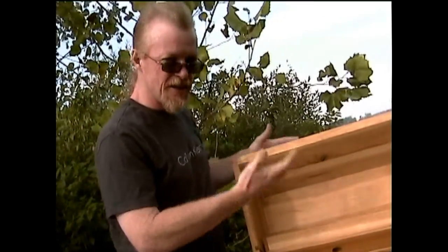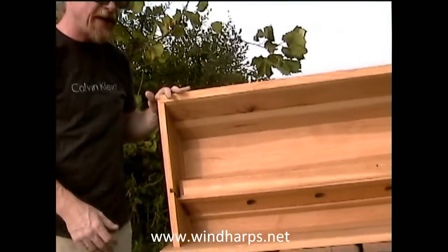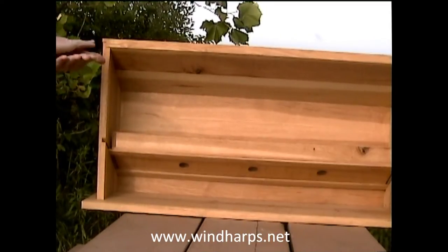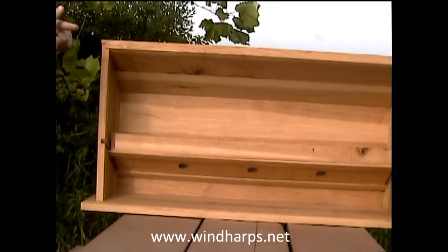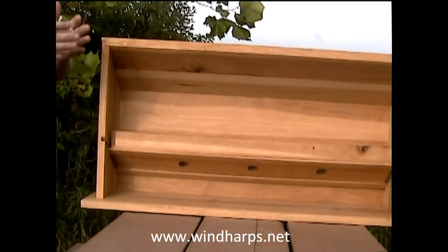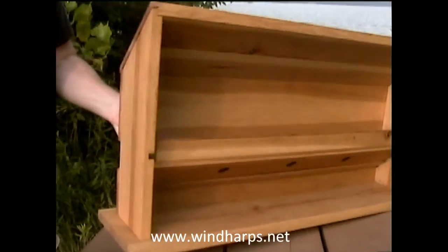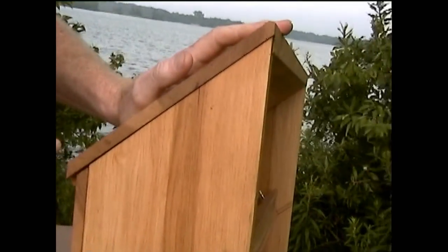This is a historical recreation. It is crafted out of quarter sawn hickory. If you remember from our series last week, I described how the various woods were cut. The flat sawn material, where it's sliced through the log. Then there's the quarter sawn material, where the log is indeed quartered and then the quarters are effectively flat sawn. The rift sawn, where the quarters are sliced diagonally.